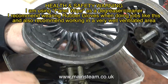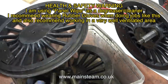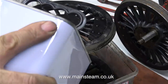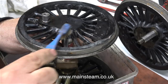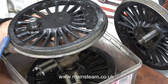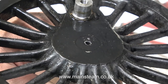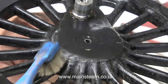Time to bring in the heavy artillery — this is an old toothbrush. It's not the one that I currently use. The toothbrush is definitely better for this job. It allows me to put a lot more pressure on the spokes and get rid of all of the grease and grime. I have to be really thorough when doing this job, because the last thing I want is to spray over any dirt that's still sticking to the spokes. First I do one side, then I turn the wheelset over to do the other side. In this clip, you really can see how quickly this stuff evaporates — watch this.